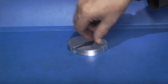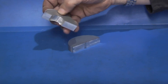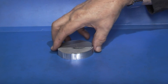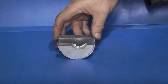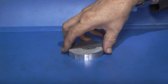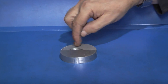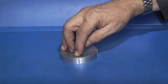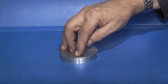I found these two semi-circles of 15mm thick aluminium — these are just off-cuts and I think I might be able to make a clamp out of this. What I've done is just mill the face flat on both of them and put them together. What I'll do is put two cap heads through so this will clamp together, machine the bore so it will clamp onto a pipe, and then make a hole so I can locate my digital readout display onto the milling machine pendant.